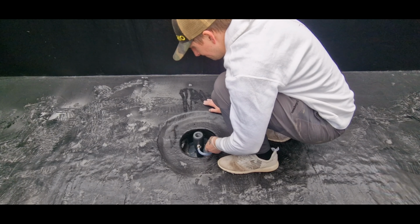And got this wire here, the flow switch to connect in. It just goes where that red loop is there, in like that, once the drum's set up. Once I've given it a run test and make sure everything's flowing properly and the right height, I get the probes at the right height, and then I'll set the LP switch to the right height and plug that in, and that'll just stop the pump from running dry. If it gets down below the sensor inside, it just shuts off until there's enough water to create the circuit again.